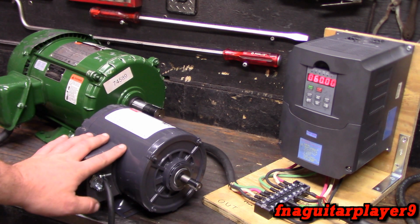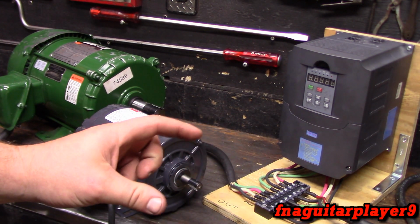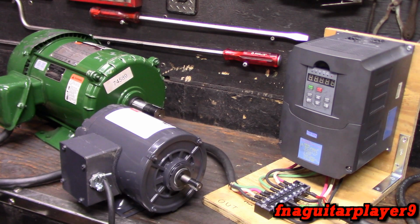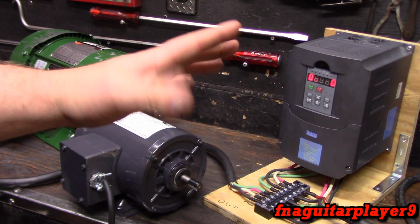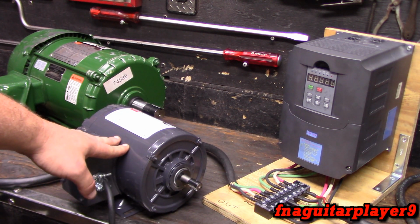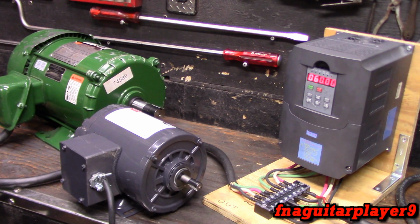The next video is going to be about rotary phase converters and phase rotation meters. I found out the phase rotation meter, at least the one I got, doesn't want to work on the output of a variable frequency drive. I guess where there are different frequencies being mixed in, it's just not working right with it. But it does work with true 3-phase power. So if you're interested in the rotary phase converter, using this motor to generate 3-phase power from single phase, stay tuned for the next video.